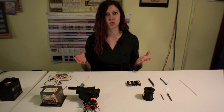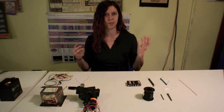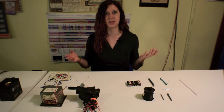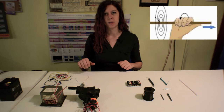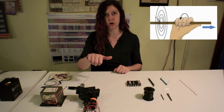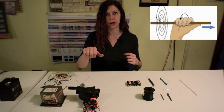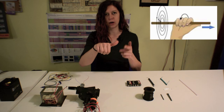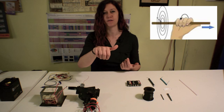It helps to know the direction of the magnetic field lines when we're trying to make an electromagnet, since that will tell us how to best design our electromagnet. You can use a variation on the right-hand rule — you point your thumb in the direction that the current is flowing. If I have a straight wire carrying current in this direction, then I curl my fingers, and the direction that your fingers curl naturally is the orientation of the magnetic field lines.